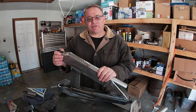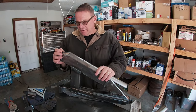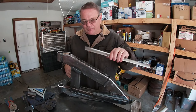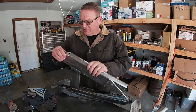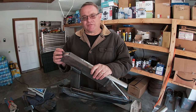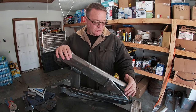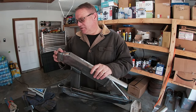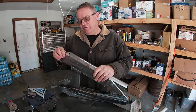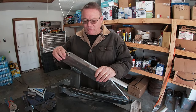I have no idea what these things will weigh after I'm done. Right now it's 17 pounds, 17.5 roughly. Adding a plate, adding this is like a pound, it's really not much. So 1, 2, 3, 4, and then probably end up around 20 to 25 pounds completely done, which is a lot. I agree, I understand, and that's one of the reasons why I wanted double shocks and bypasses that could help control that weight, the mass going up and down, hitting rocks and things.